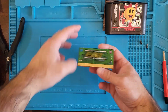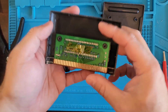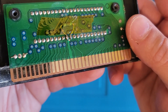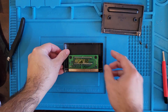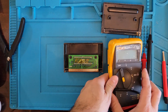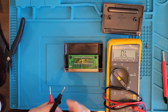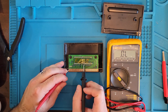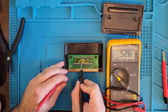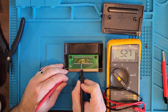Now let me show you the repair up close. You know what you should do before we slam it back together? Get our meter back out and see what kind of reading we have now. This pin here is ground along with the red probe — we have 526. We did have 640 on the other ones but I think this should be okay. Let's give that a try.